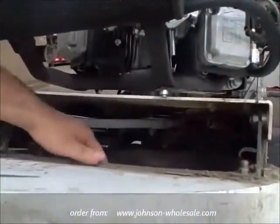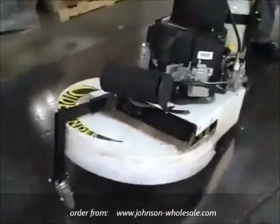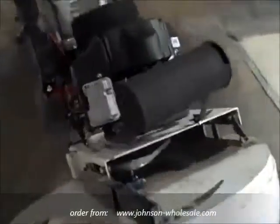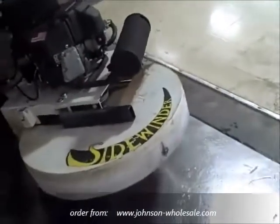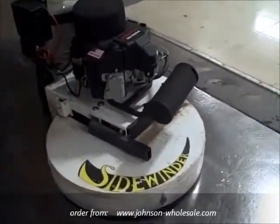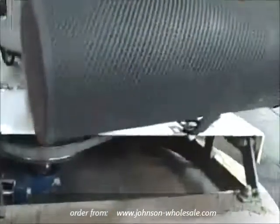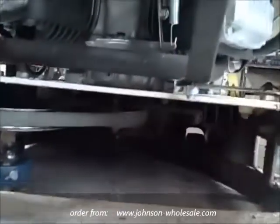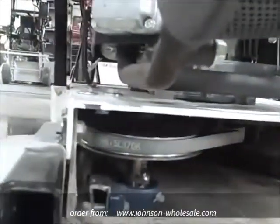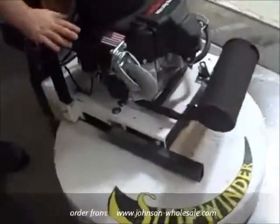Because of the gimbal drive, the brush drive will naturally pull down, thus lifting the pulley up. I'm going to lift the machine back. Zach will remove the front transport wheel. As you lower the machine to the floor and look at the pulleys, you will notice that all pulleys are in a line. The transport wheel is placed in and stored in the steel sleeve just behind the engine.